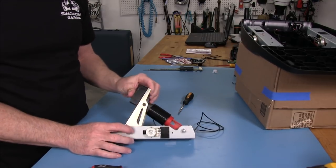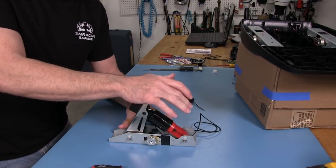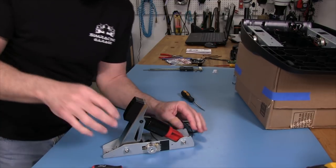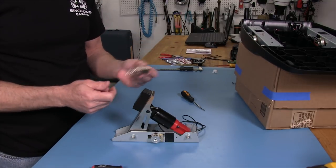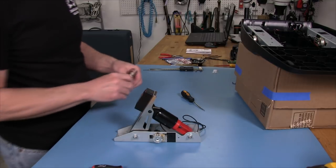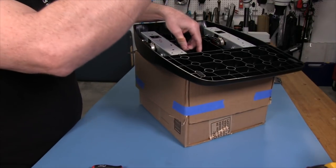This is an alien brake pedal now. You get that little bit of push there at the initial press — like a hydraulic system before the pads are actually grabbing the rotor. That's what it simulates. And then once we're there, we can push a little bit further and we're just pushing against the load cell at that point. This is a whole different feel. It's so stiff now — which is exactly why it's better to take this brake spring, put it in the clutch, and put the clutch spring in the throttle, to balance the feel out a little bit. So we'll drop this back in, get our wires hooked up, and we should be good to go.